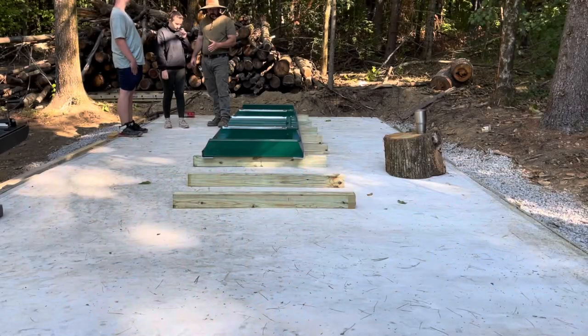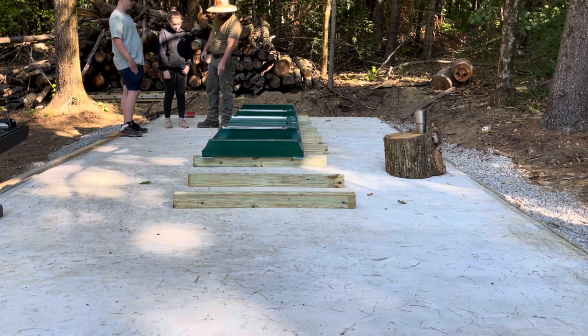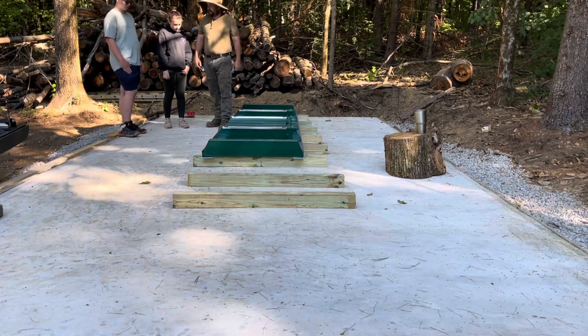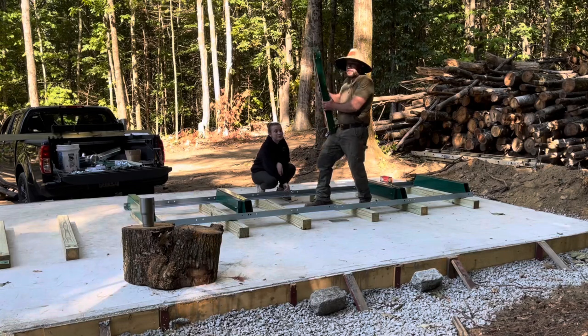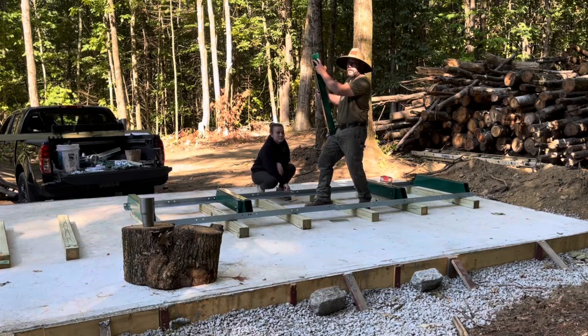Alright guys, so here's the deal. The M35s are longer, 35 millimeters. So those are gonna go in the middle bunk with the spacer in the bottom. The M25 millimeters are gonna be for the other bunks. Let's get them tightened. Make sure your very center bunk that connects your 2 angle irons has the 4 holes per side, not 2.